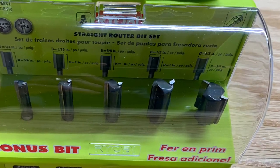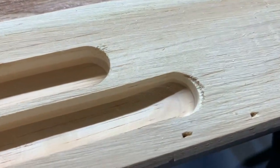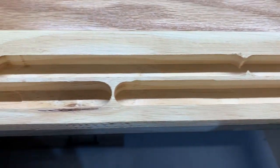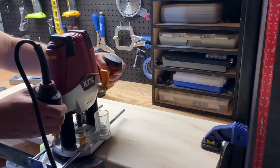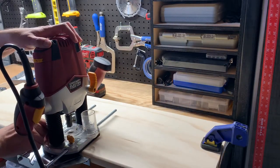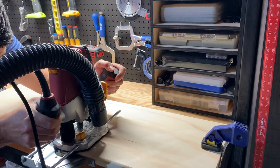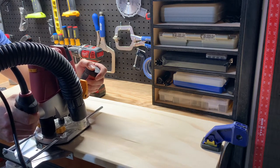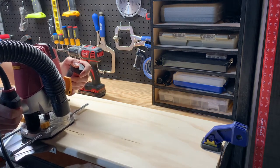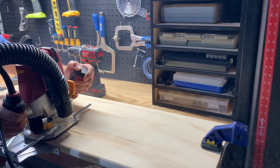Next it's time to customize the tray. I used a five-eighths inch straight router bit for the cell phone slot. I strongly recommend practicing on scrap lumber to make a straight line and clean cut. I wanted to test for the right bit size and depth so the phone would be sturdy without needing any other support. I marked a line two inches in that was eight inches long, centering it on the board to allow plenty of room for a phone. I double-checked that I had 14 inches of space on each side to ensure it was centered. I used a plunge router with the edge guide to get a nice straight line, and with taking out a half inch deep of material, I made multiple passes — I strongly recommend at least two passes to yield a clean result.